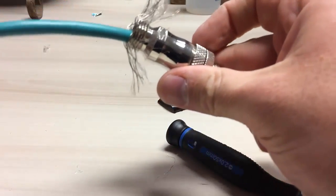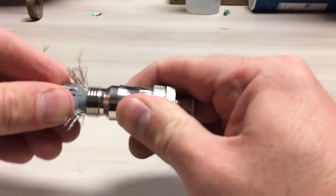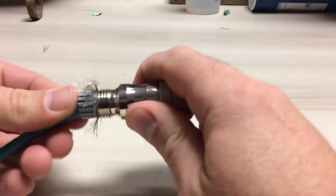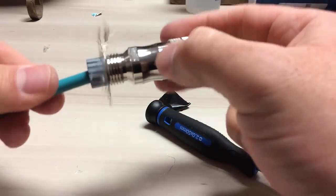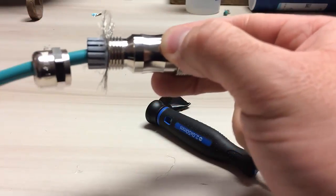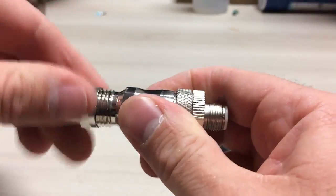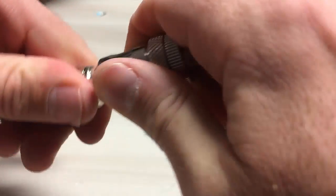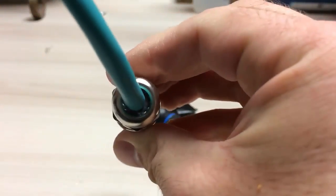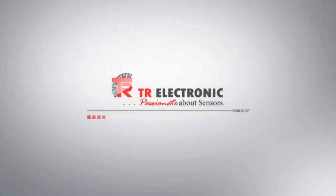Try your best to ensure that no stray shield wire falls back inside the connector body — just wrap it around like this. Take the gripper and push that in. It's all keyed, so you'll need to locate the key point and press it in. Use a pair of scissors or snips to cut off all the excess, then screw on your coupling nut. There's no torque specification; it really depends on the diameter of the cable — just want a nice good grip. Your coupling nut should look like that in the end. And there you go.